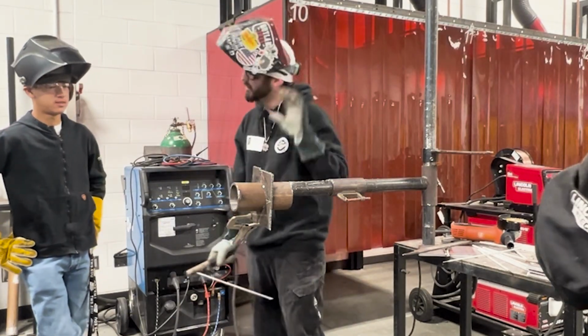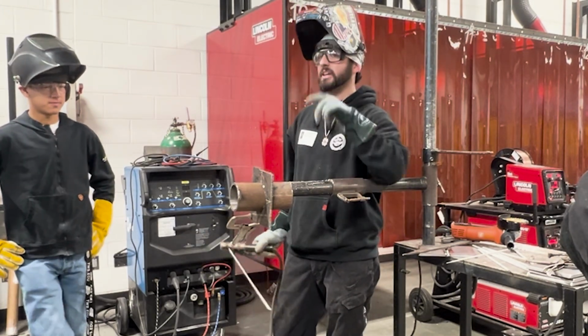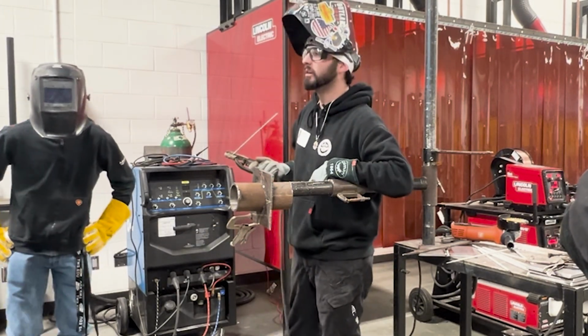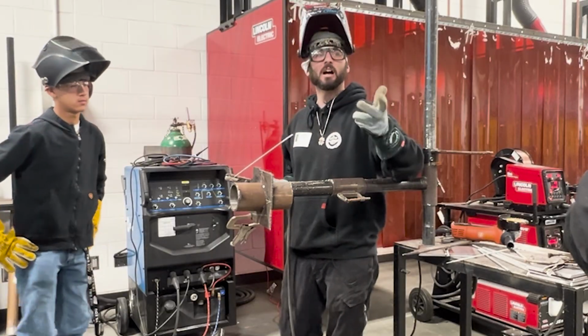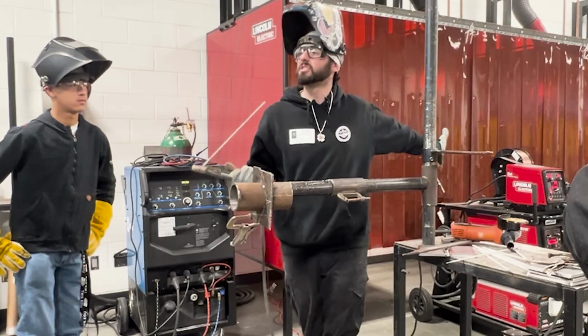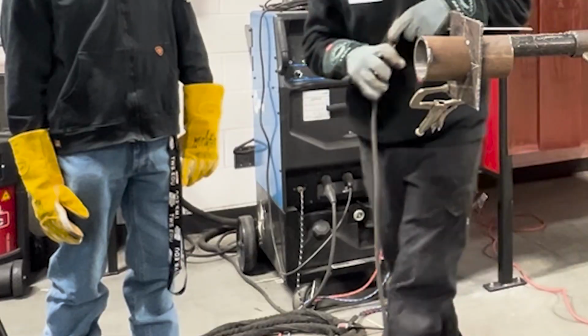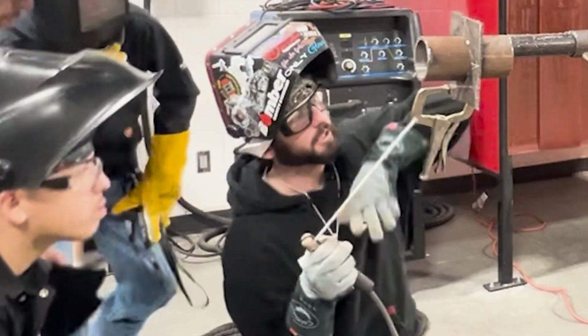So when you switch rod, you're not going to change anything. Don't need to. It's the same rod. It runs the same way. It's just more metal. Now, if I do think that it's digging more because I have more heat now, then I might try to favor that soft again. But this machine's picked the soft for me already. I don't want to over soften it. I want it to lay down. So let's start it again here at the bottom.